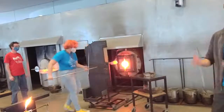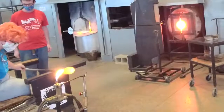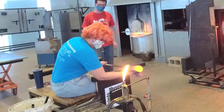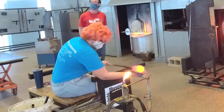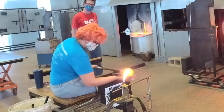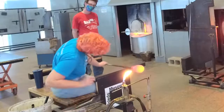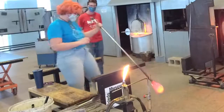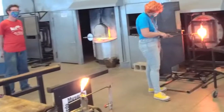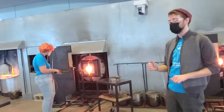When blowing and shaping on your own, you know exactly how much air pressure you need because you're the one giving it. The newspaper tool works similarly to the blocking tool — it's soaked in water, and that water evaporates when it contacts the molten glass, creating a layer of steam that prevents the paper from burning and also cools the glass. We can see the bubble slowly beginning to inflate. We need to do this slowly because a conical form is a notoriously difficult shape to achieve.